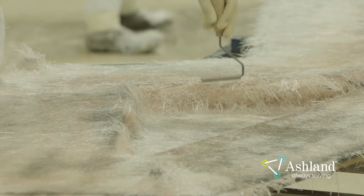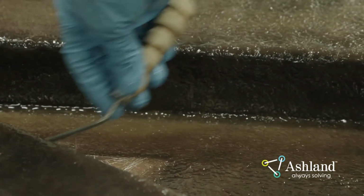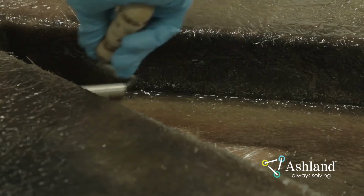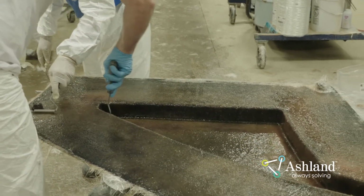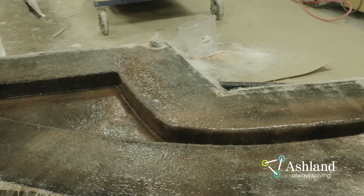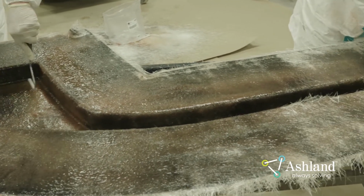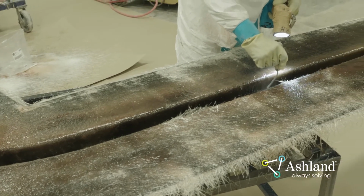This type of roller has become widely and sometimes overly used in the open mold FRP industry due to their ability to easily compact the laminate and remove large air pockets. However, they can leave resin-rich lines on the part, which will transfer to the cosmetic surface. They can also leave fine air in the laminate that can create rework and warranty issues, like blisters, in skin coats. It's best to use them only for bulk lamination.